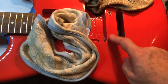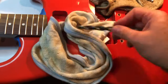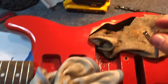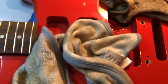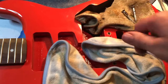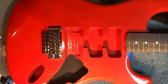Quick postscript: get yourself a sharp drill bit — not a brad point — and ease these holes a little bit. That sharp drill bit will remove the paint around them. Otherwise you're going to get chip out, especially on a new paint job. I got my threads here covered with wax. I also had to cut these slots with a hacksaw because they weren't deep enough and the regular screwdriver was just slipping out of them. I always like to cover the area with a rag as well when screwing these things in — you'd hate to slip off and dig into your finish. There are your PS tips.